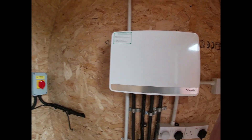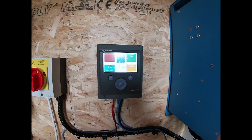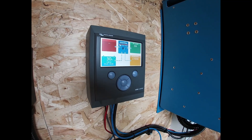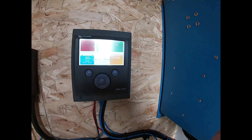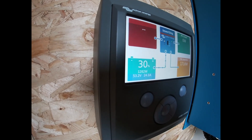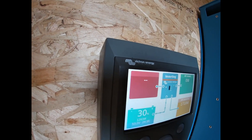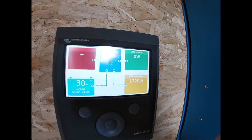It's working fantastic — we've had zero problems so far. We have got our generator wired on an auto-start, but at the time being I seem to have it in the wrong auto-start slot on the deep sea module. So all I've had to do is just check this once or twice a day, see where the batteries are at. If it gets too low — around 20% is the lowest we've had it so far — flick the generator on for an hour or two and we can get it back up to a hundred percent.